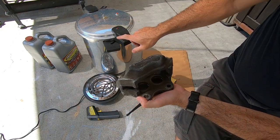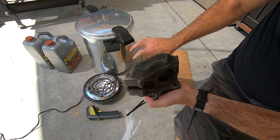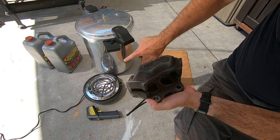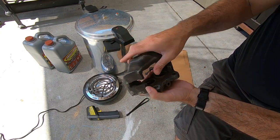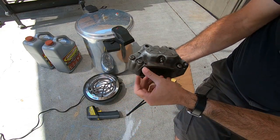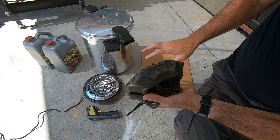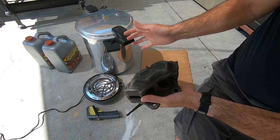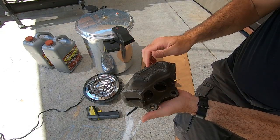We're going to put the vapor rust in my old pressure pot. I'm not going to pressurize it — it's aluminum because I don't want it to react. The vapor rust only works on iron, so any rubber parts, brass, or anything else left on it won't be affected. 140 degrees is what I've read is perfect — 30 minutes should get rid of all the rust.